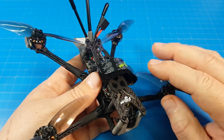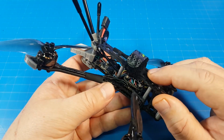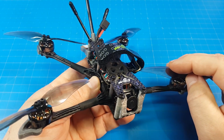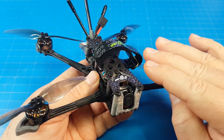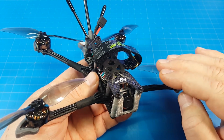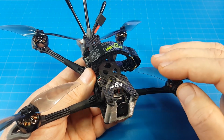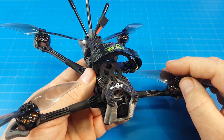If you have a fail-safe, which this has, the FrSky XM Plus in it, so not a traditional long-range receiver, but depending upon your perspective, you may see it one way or another. If you have a fail-safe, the GPS rescue will kick on. In the end case where I showed you, it was coming in the general direction, but it wasn't coming directly back to my home point.